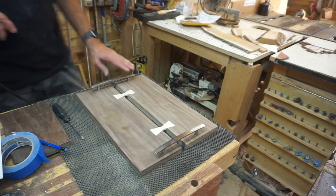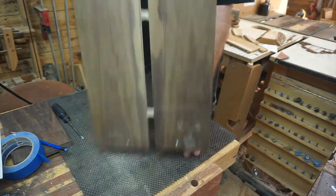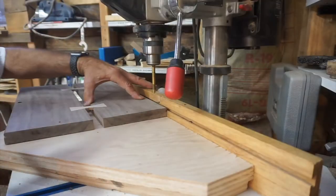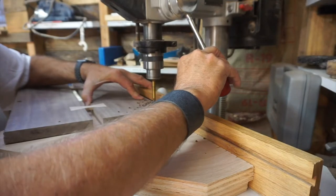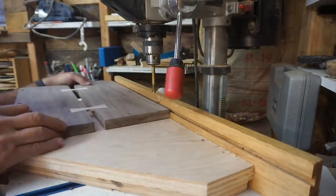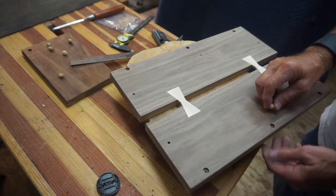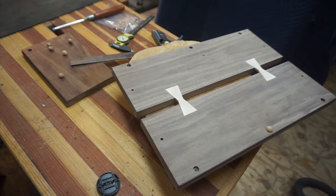So there it is with the longer handles on there. Got it all mounted. Countersunk the screws in the back. Now, get to sanding this thing. Take the handles off, sand it, get the finish going. Okay, I'll double check the fit here. That's going to work. So now I'll get my little 220 sand and we'll install these things and we'll start finishing.